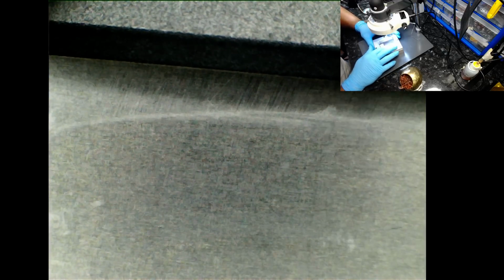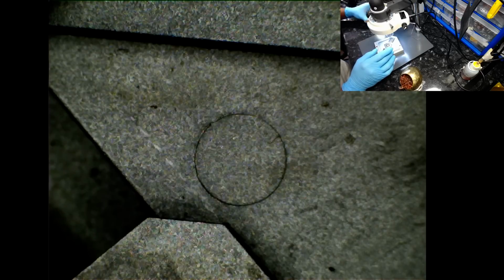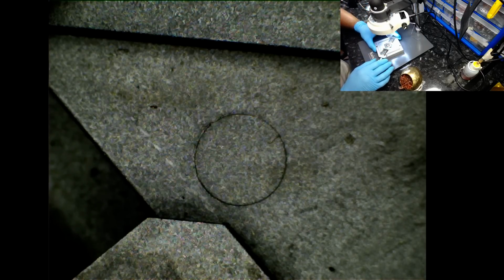I mean, direct heat is cheaper to buy versus what I paid for these stencils, which is why I'm not buying another set. And secondly, it can be a little bit easier to work with, whereas with these, if you put too much flux on the chip, then the reballing can turn into an absolute nightmare.